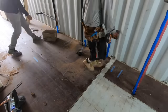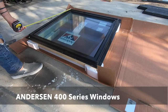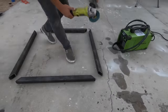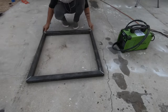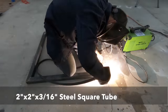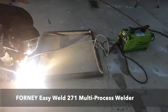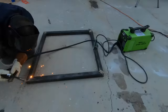While the rest of the crew worked on the insulation and floors, I began making the structural frames for the doors and windows. After double-checking the dimensions I made 45-degree cuts to create a mitered frame. The shipping container gets its strength from the continuous corrugated panels, so whenever you cut one of these panels you have to reinforce it. For these first few windows I decided to use 2-inch tube steel. I did all the welding using a little Forney welder — an inexpensive machine that's easy to use, great for beginners, and powerful enough to build a house with.